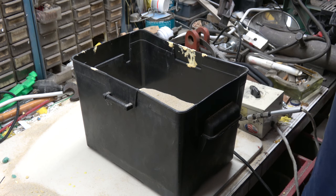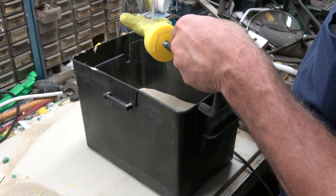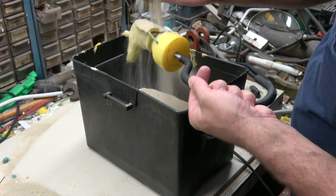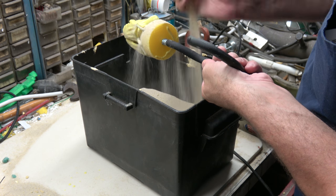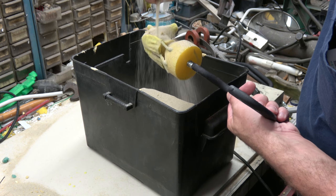Looks pretty good. Get old Jar Jar Binks down here. I'd say one thing, the mold lay, or lay mold, or whatever it's called, looks like it takes the ceramic shell coating better than the PLA does. That'll be interesting to see how the two compare against each other on the finished casting.